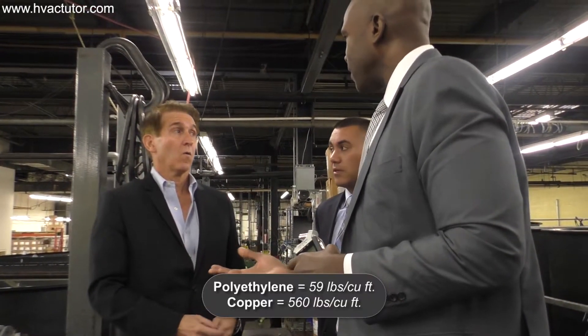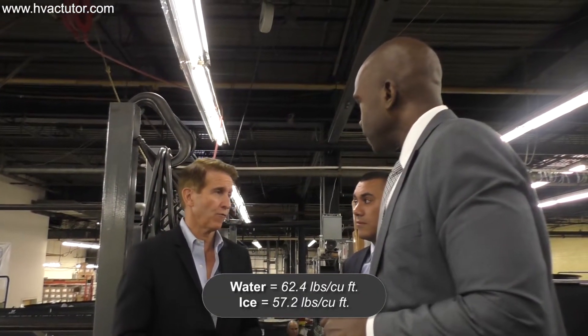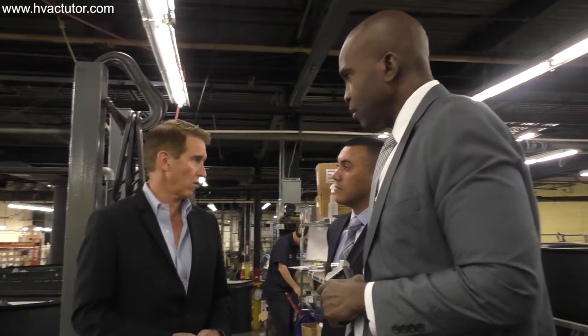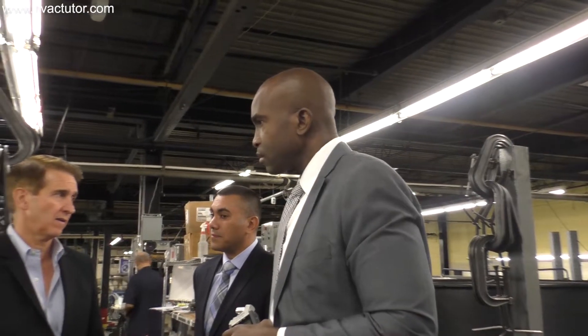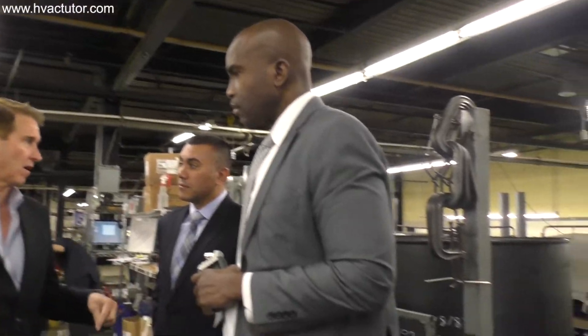Since this is all polyethylene compared to metal, it must be super light. Well, once you put it in and add the water you go from 1,800 pounds to 18,000 pounds — so that's heavy. But for instance, the TIA Craft Building has tanks on the 28th floor of an existing building. You can put them on the roof or in the basement, and these older buildings can hold the weight — you just have to distribute it to the columns.